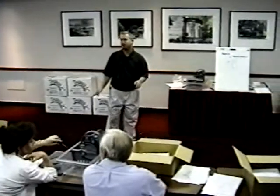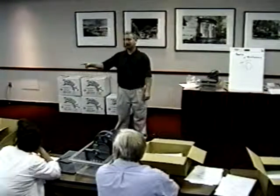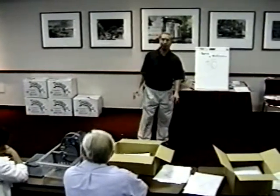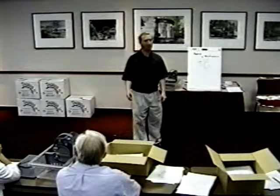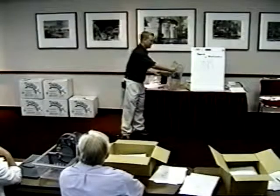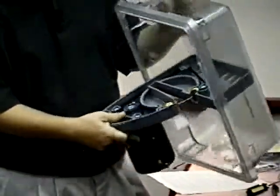Does that make sense? It's pretty straightforward, no confusion. For older customers — or anyone with bad lighting or poor eyesight — they're going to have trouble with the L bracket because it's under the lip and the screws are small. An easy way to handle this: get rid of the water so you can flip the saw over. You can look at it upside down, you'll have great light, you can see both screws and still do the alignment. It's not going to change anything — just don't shake it around or swing it.